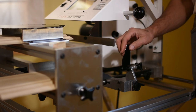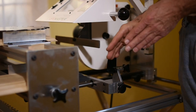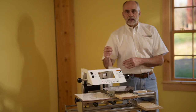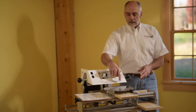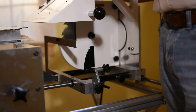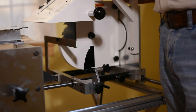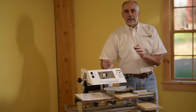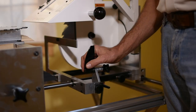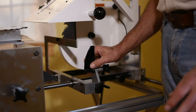If you're going into a bead — say on a baseboard where the bead is a quarter inch across — as the stylus traces it, the stylus goes a quarter inch over that bead. Because the saw blade is cutting a little bigger, it's going to cut the bead on your work piece a little bit bigger — maybe 8 to 10 thousandths. Nine out of ten times, that's not going to make any difference to a finished carpenter; the copes are going to fit perfect. For paint grade, paint covers a 5-thousandth gap, no problem. If you're really finicky and want it dead tight, you could put a piece of tape around the stylus to make it thicker and reproduce the detail more accurately, but that's hardly ever needed.